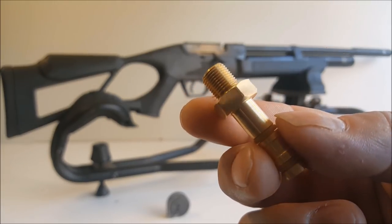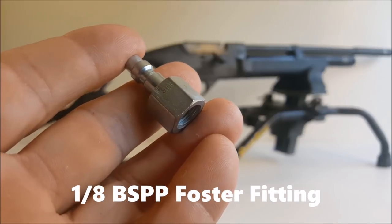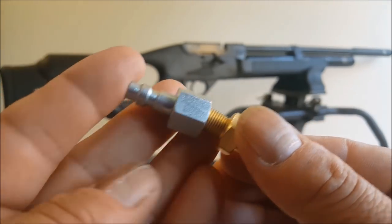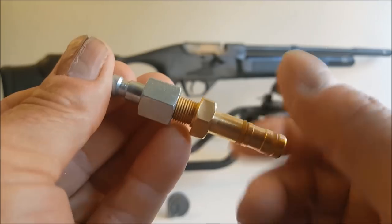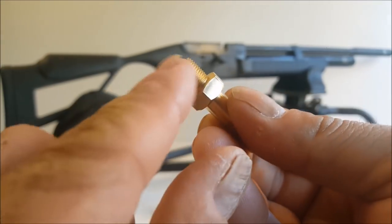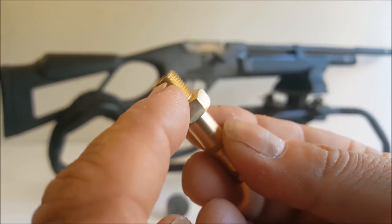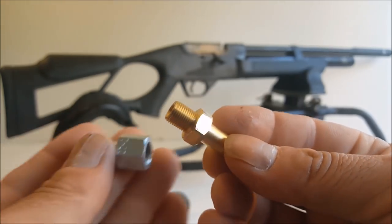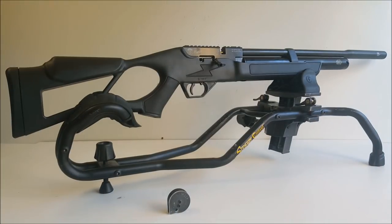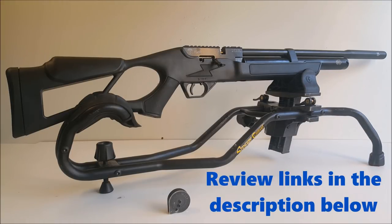Right here is the fill probe you're going to get. What you're not going to get is one of these — a 1/8th BSPP threaded Foster fitting quick-disconnect nipple. You've got to order one of these separately from eBay, Pyramid Air, or wherever, and you'll be able to screw your fill adapter on. When you're putting Teflon tape on here, you just want to make sure you don't get any tape above the threads because you don't want it getting inside your air gun. Make your Teflon tape be a few notches down, but you do have to use quite a bit. Then you'll be ready to fill this gun from your PCP pump.